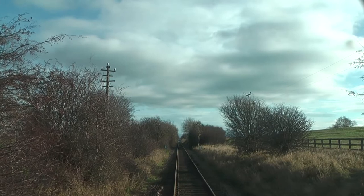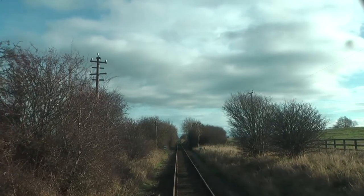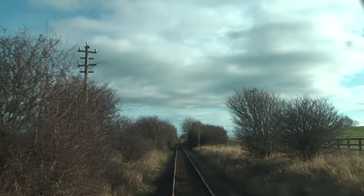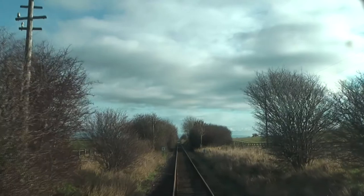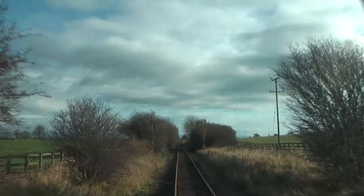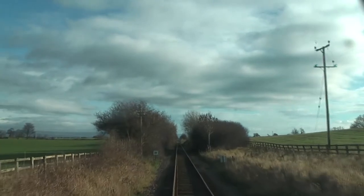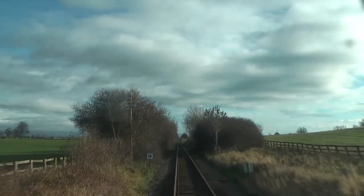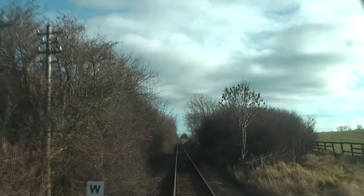Throttle back. On again. And again, a bit more. Right back, right back round. You can go right round to four if you want. That's it. And when the needle gets right up to nearly top of the yellow, knock your throttle right back and then wait till it drops into the black before you change gear. That's it, and you can go straight into second, yeah.